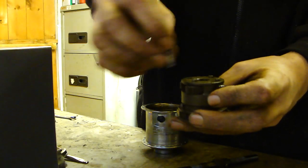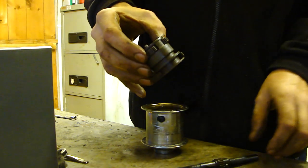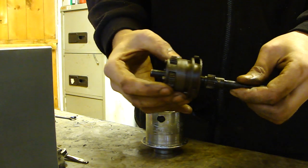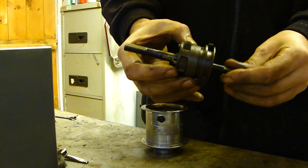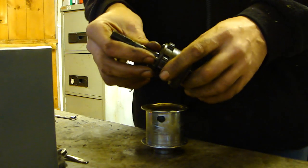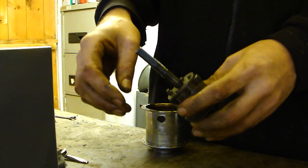3 and 4. Simple as you like. That goes through that way, so that cog there is aligned with the 4 planetary gears, so when it spins you've got that action. Good stuff. There's 2 ways of doing this. I'm going to show you the easy way this time. It's purely because it's easier.